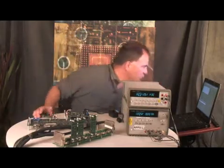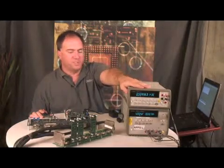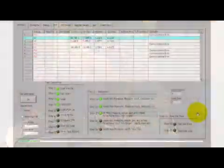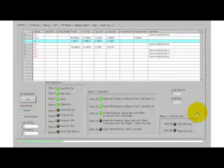After the first portion of this calibration is done, we're now working on adjusting the output to 4.5 volts, and you should see this voltmeter read 4.5 when that calibration is fully complete. Indeed, the first sensor calibrated to 4.5, and the accuracy in this case shows 0.000%, so it was perfectly calibrated at least to the resolution of the software.